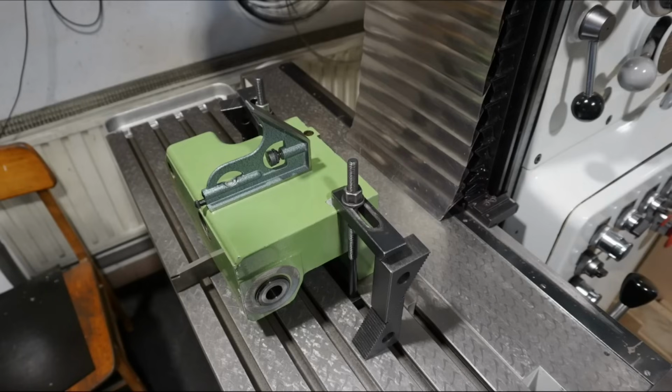Moving on to the tailstock, at this point in time I also made the call that I wanted everything hidden away on the back side of the tailstock as much as possible and out of the way of the work. So this required a fair bit of planning ahead, because for example the hole that supplies oil to the quill of the tailstock has to pass through a rib on the inside of that casting, and I had to make sure that I wouldn't hit air on the inside.